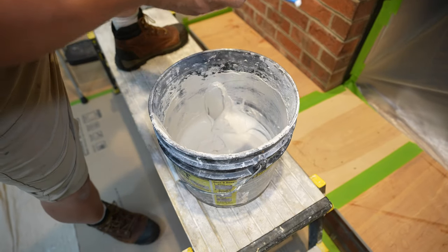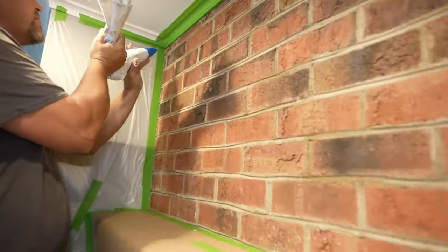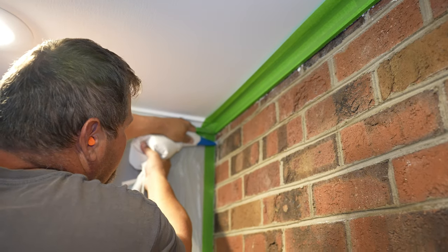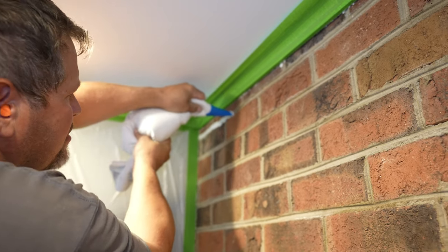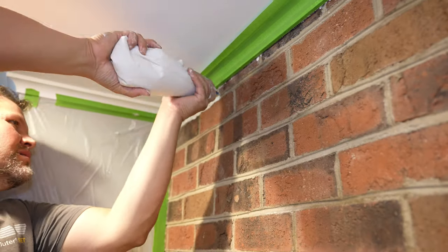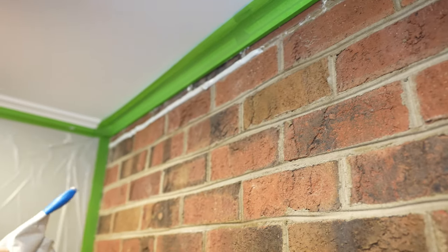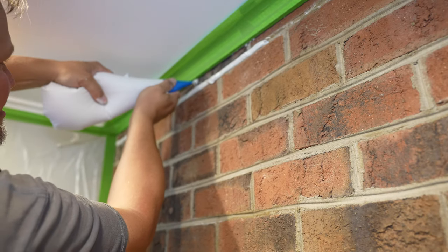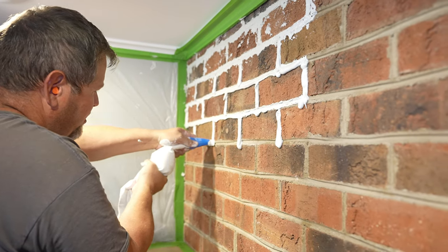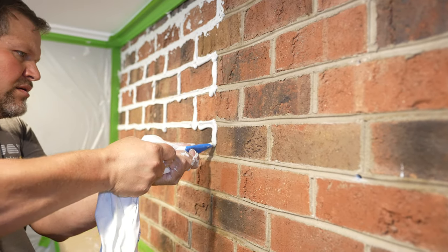All right, we can probably work with that. I got my grout bag here. One tip: make sure you keep the grout bag with the tip somewhat on the decline or pointed down — that way it'll help you not get bubbles in it. I'm going to follow this through the entire chimney. With the type of mortar joint I have here — grapevine, key mortar joint, whatever you want to call it — it's a strong mortar joint, but not very appealing to the eye. By using the grout bag, it really fills in the joints pretty excellently.